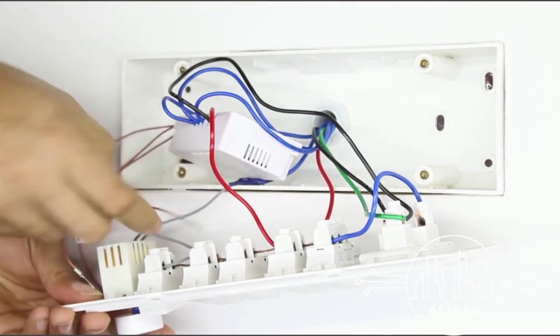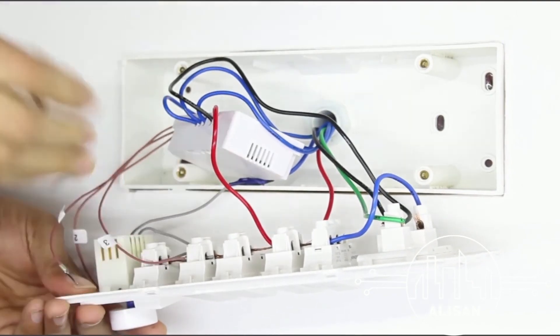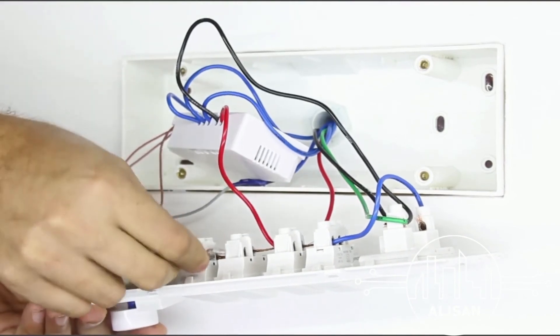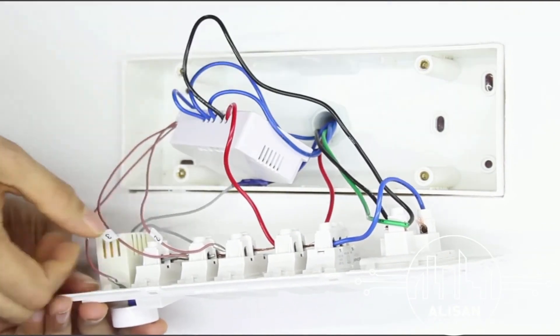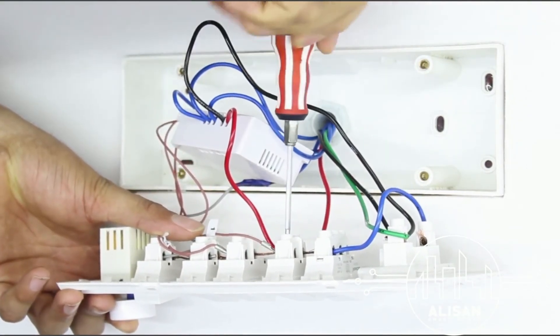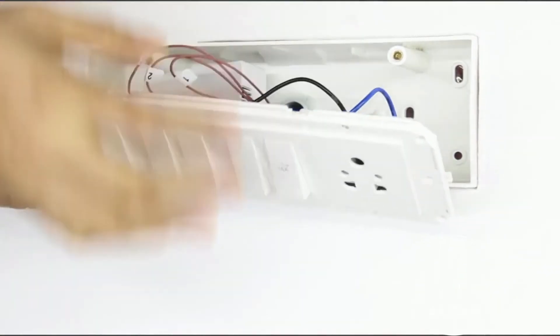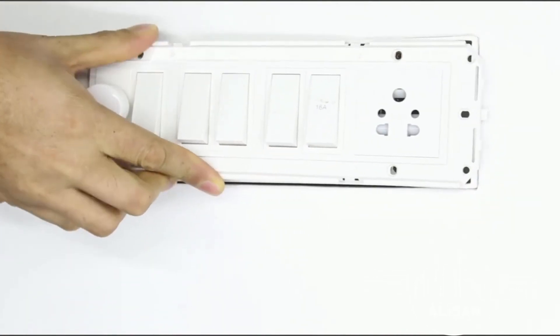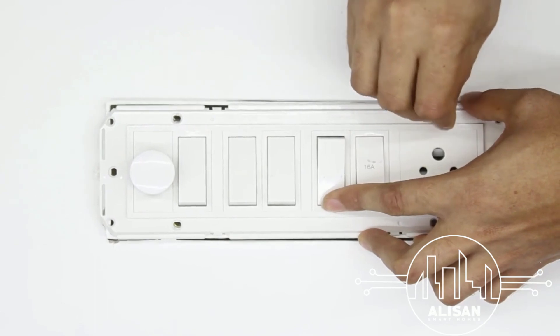Take the virtual wires 1, 2, and 3 of the device and connect them to the load pin of the respective appliance switch. Once you are done connecting all the wires, insert the 3 Node Switch inside the switchboard and reattach its wall plate firmly back onto the wall.